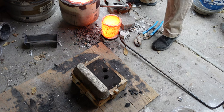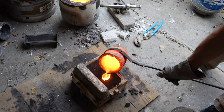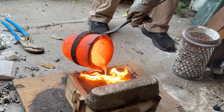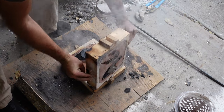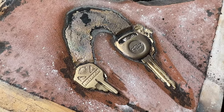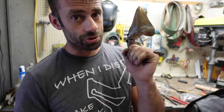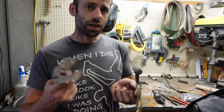Here goes pour number two. Still not quite there — the metal cools at such a fast rate that it's not making it to the end of the key before it solidifies. Another failure, but another shark tooth available on Etsy. The truck key is really close; the house key, no. I think I'm gonna need to try a vertical pour — that always solves the problem.